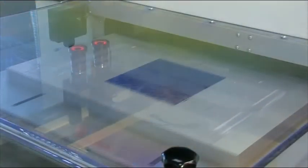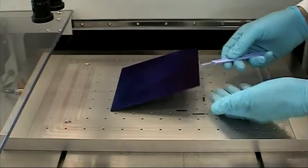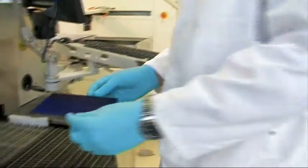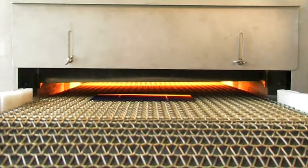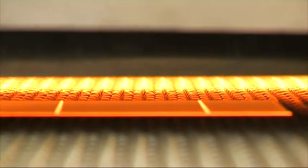Both processes deliver substrates ready for the next step: etching. For good line definition, a quick transfer to the oven is vital. For most pastes, etching is accelerated by heat from 150 to 400 degrees Celsius depending on the material, layer thickness and time.